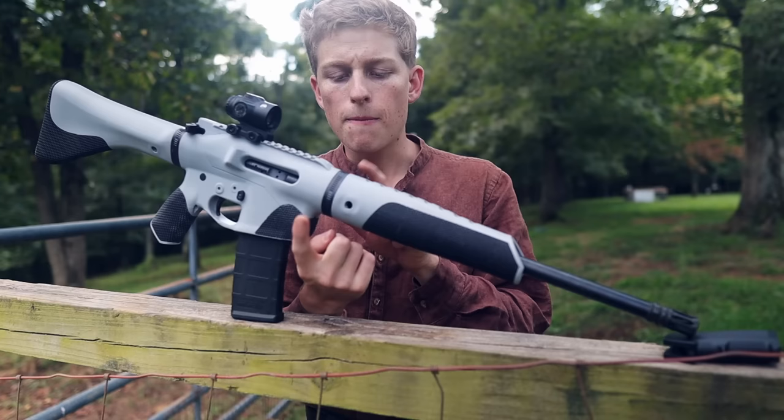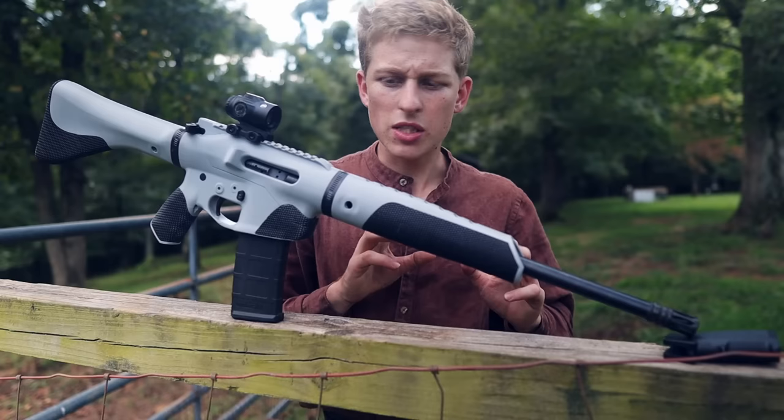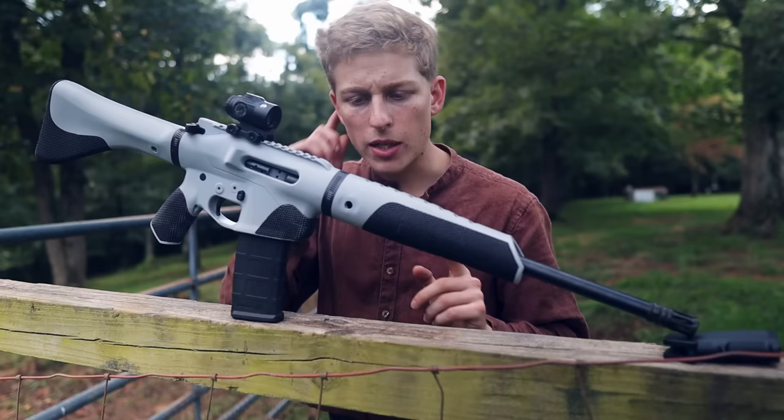easy to use with my clip mounting method for my handguard. It really integrates well, and it also allows me to make those clamshelled parts from a carbon fiber nylon, which is insulating and is also heat resistant, so that helps protect the rest of the gun, and those small parts can be made from the carbon fiber nylon, so you don't have to be printing a whole gun from it. So that was really great.